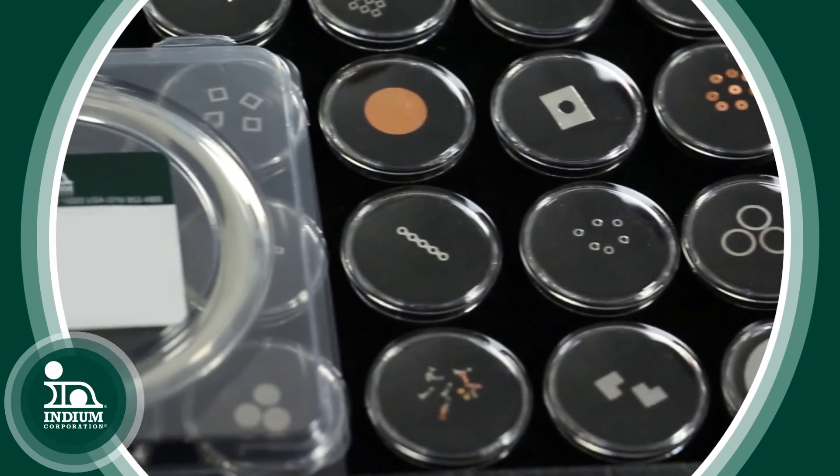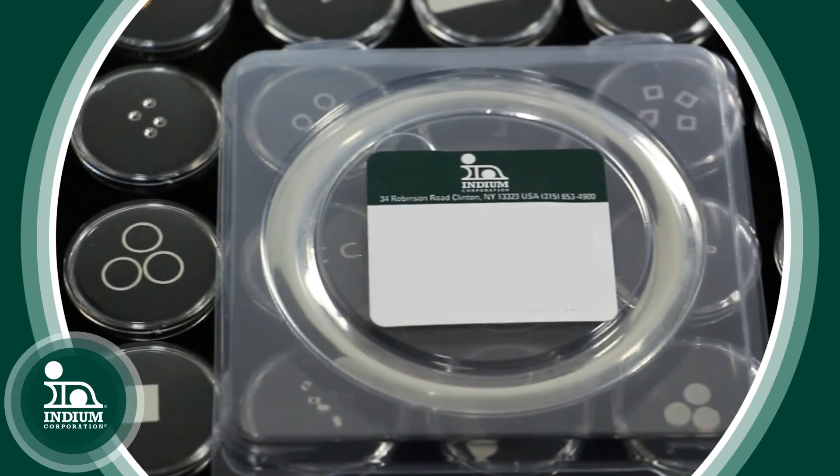What are some of the configurations these preforms can be manufactured to? Definitely it can be made into paste — you need a special flux because of the lower temperature, but it can definitely be used in a lot of surface mount applications. There's also solid wire, ribbon, and most interestingly, preforms. We can do them in a lot of different shapes, sizes, and thicknesses, and we can make them exactly to your application so that it fits your components and boards. We do a lot of fusible alloys that are more solid, and frames for hermetic sealing, and washers that are used in connectors, and just all kinds of different options.